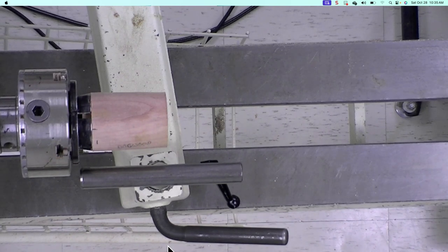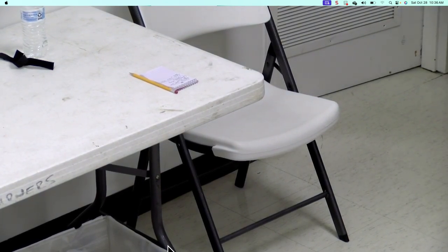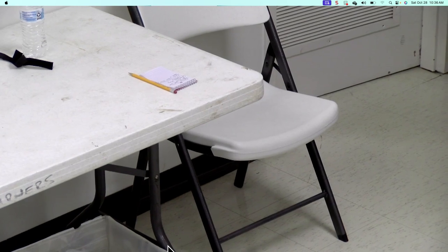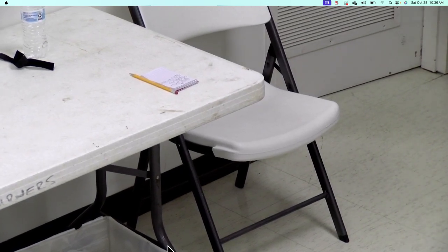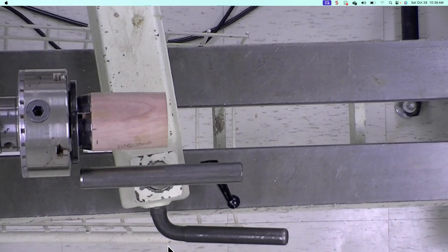Another option, I don't take credit for this, guys, because I'm not that smart. What the guys do is they take, what are the two most common threads in the country? It's 1/4-20 and 3/8-16, correct? This is a 3/8-16. Just so happens that the inside diameter is 5/16. So this is a 5/16 rod, and I put two hex nuts on there, and put hot glue on it to stabilize it. So I can lay that on the platform. A hex head nut has got six sides. I need every other side, so I just go every other side, and I can get a three-point. So here's the first one. Follow me? Take that.